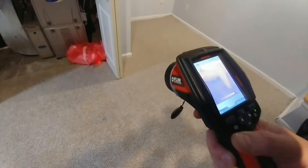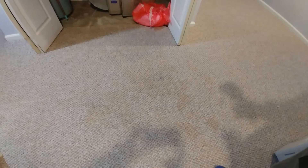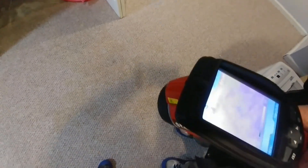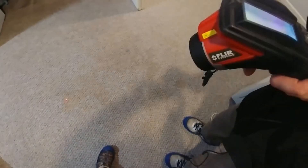Now if you look at the carpeting with the video camera specifically in this area, you can see yellow spots. This is where the carpet pad has taken the contaminants from the subfloor, and the pad itself and the back of the carpeting has wicked itself up to the surface as it dries. Wet is always seeking dry, depositing contaminants — dust, dirt, and stuff that goes into carpeting — to the top of the carpet fibers. That's the yellowish stuff we see here; some of it may be rust from the water.